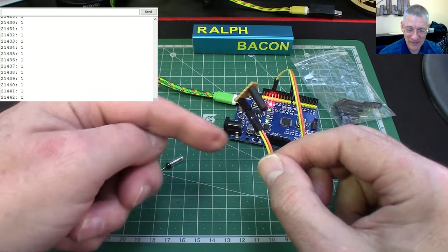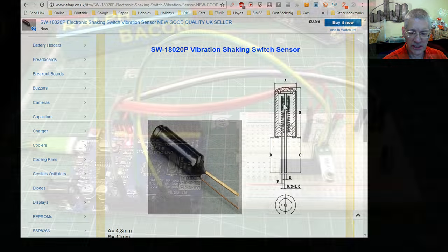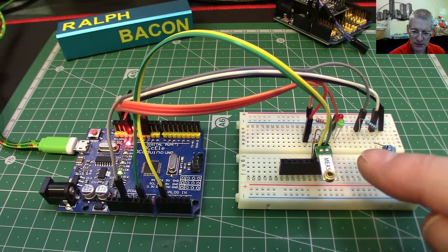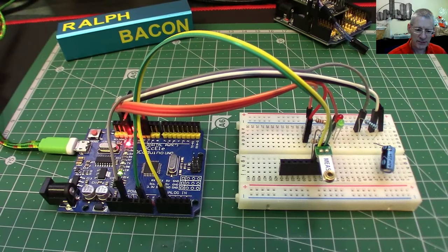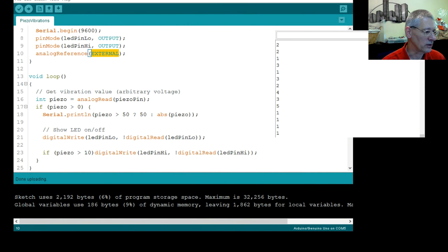Back to the main video. What we've got with this piezo vibration detector is an analog version — you can go from nothing all the way up to 1023 steps, and by specifying an AREF voltage you can make it as sensitive as you want. Having tracked that value in the serial monitor window, it would be better in some ways if we could track it on an oscilloscope — but rather than drag you all the way downstairs, there's something else we can do.